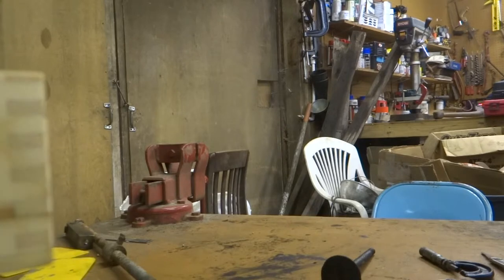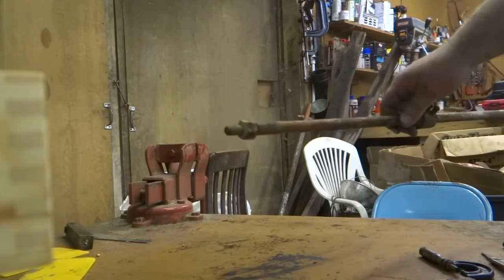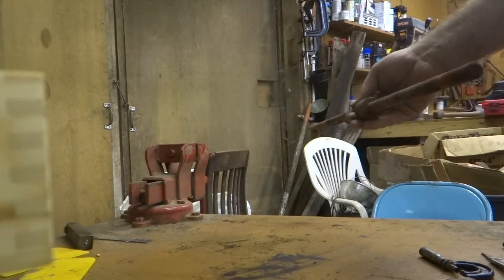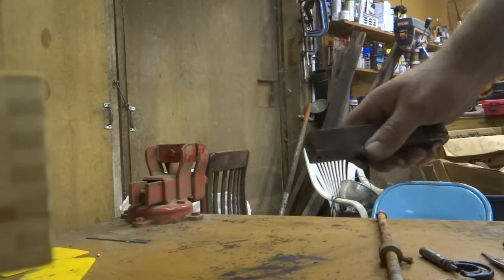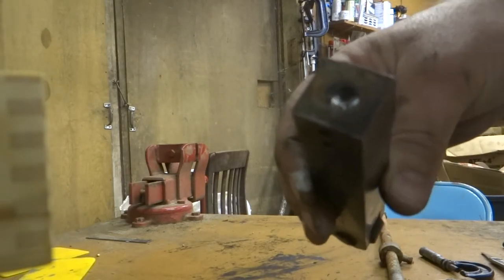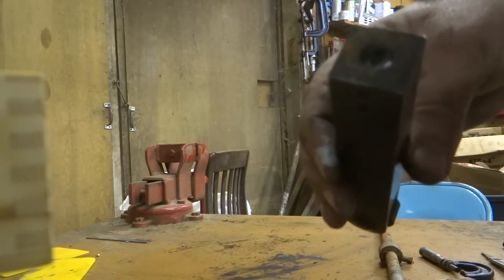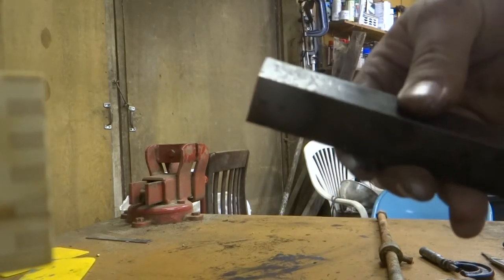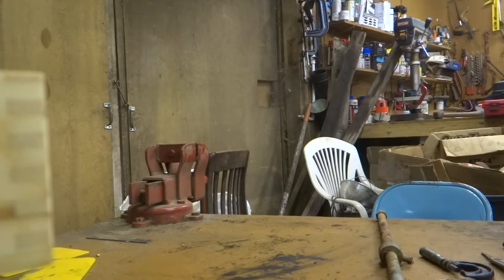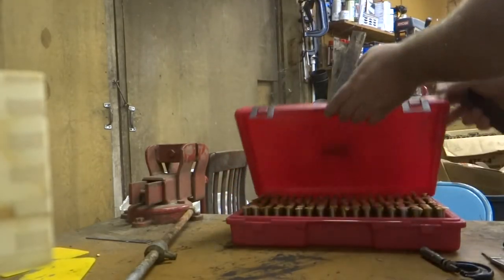We also did, and I wanted to show you this, we took measurements of our old push rod that we're going to replace. And if you remember right, this piece right here, we were broken off in there. And I wanted to get an exact diameter because I'm going to have to order an end mill or flat bottom drill bit to get that hole cleaned out to make this work properly. And I got out my plug gauges, which I normally use for work with revolvers, which is why I bought them, which is why a lot of these have never been opened.